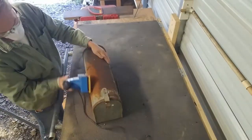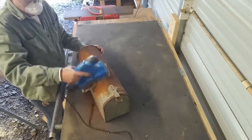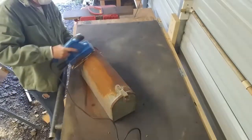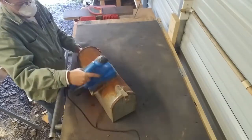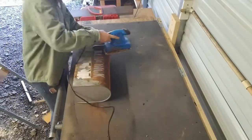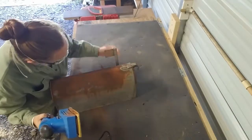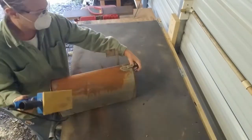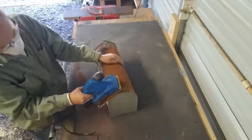After cleaning up my sticker mess, I moved on and tried to remove some of the rust from the box. I'm using 100-grit sandpaper and went over the box a few times, taking off a good bit of the rust. I knew I was going to be using Rust-Oleum paint on this box, so after sanding it well, getting all the sticker residue off and most of the rust off, and working with a smooth surface, I decided that once I got it smooth and got most of the rust off I would be good to go on paint.